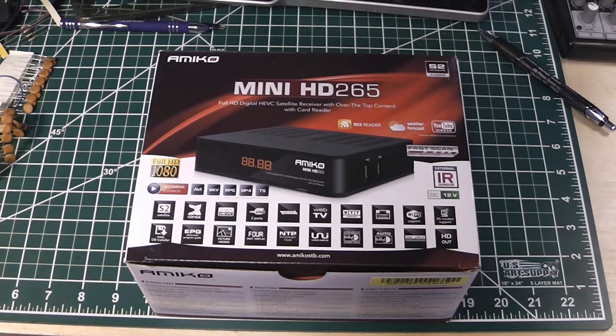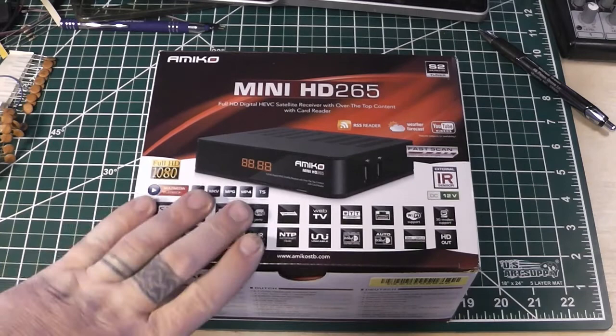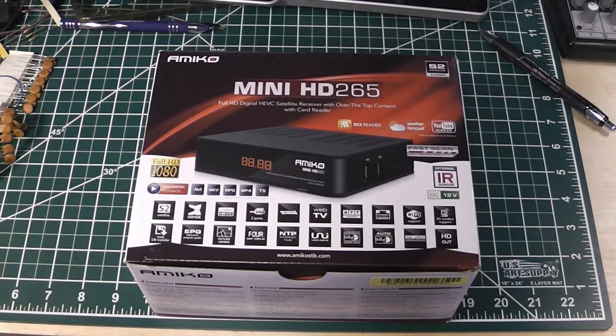You go into the menu on an older box, just from 4 or 5 years ago, like, say, the Mini HD SE or something. If I'm testing one for a customer, I'll hook one in, just plug it in, check it, and I can already see, I'm like, whoa. It's like, come on now, let's get to this menu and that menu, and let's try to change a switch setting or something. And I know you've seen this where you get down to change a switch setting. Say you've got a 1x8 switch, a DiSEqC switch, and you go down to it and you just click over 5 times because you're on port 5, and nothing happens right away. Your mind's seeing that and like, nothing's happening here. So you might hit it a few more times, then all of a sudden there it goes slowly, 1, 2, 3, 4, 5, 6, 7, and it just keeps going because you hit it too many times.